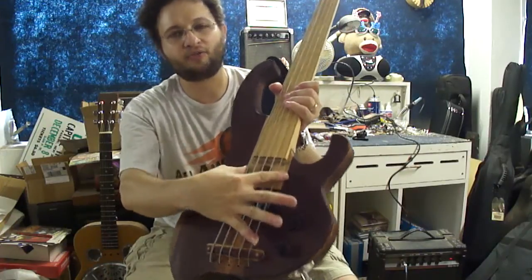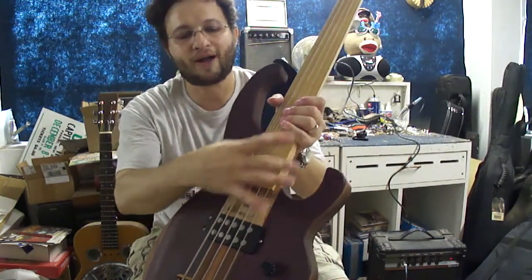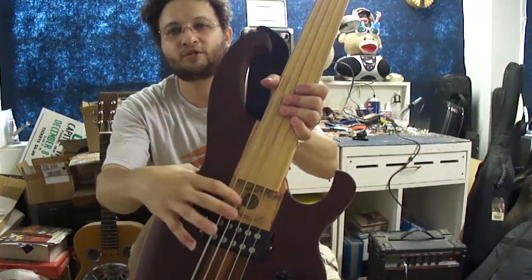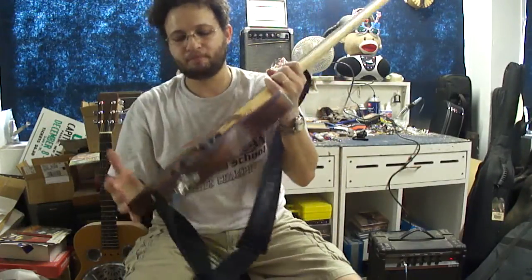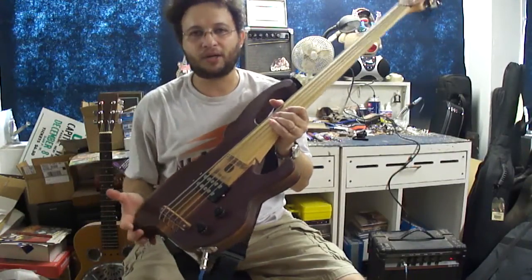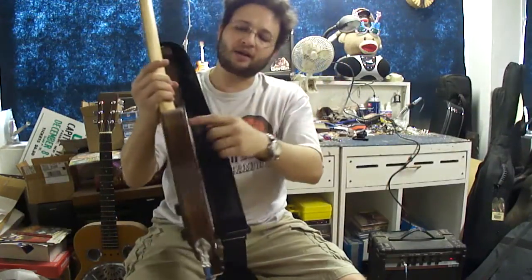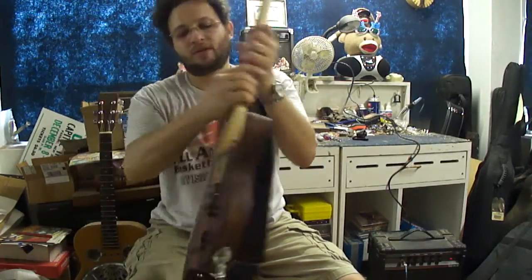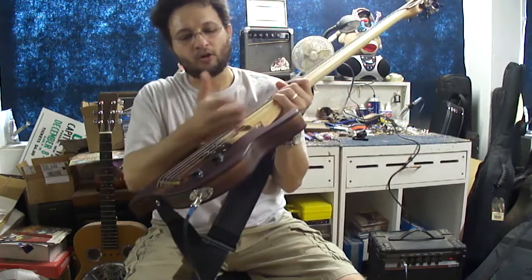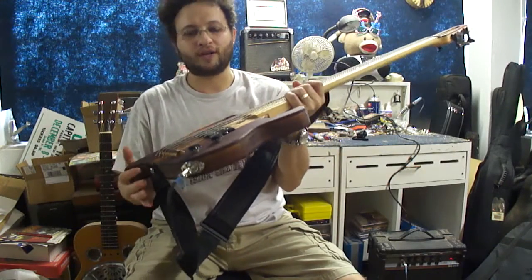And then here I have 1/4-inch red oak that I grafted in for the company information, as well as my doubloon. This is what I call a hybrid between a neck-through body and a set neck, because it's a set-in neck that's deeply set all the way to the pickup cavity. So it's a really nice long tenon to it.